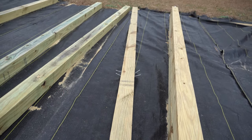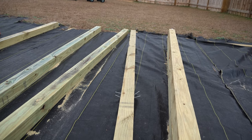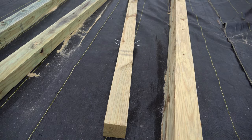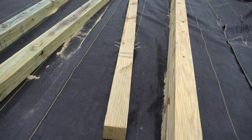So in front of me right here, I have a whole bunch of 4x4s that are made out of pressure-treated wood, and they are all 10 feet long. When you bury a 4x4 — any time you set a post — you're supposed to set a post anywhere from one-third to one-half the depth of the post. And everybody pretty much agrees that you use a third, not a half. That's way too wasteful.